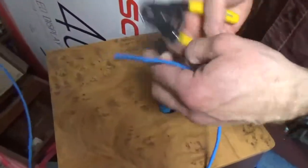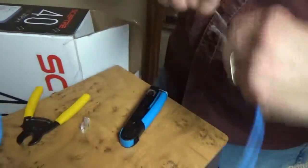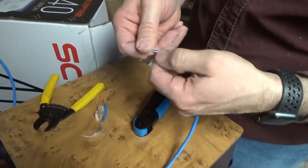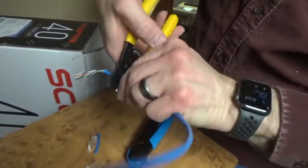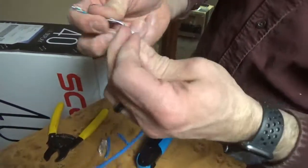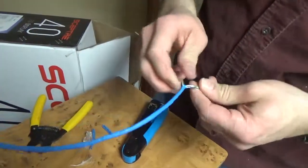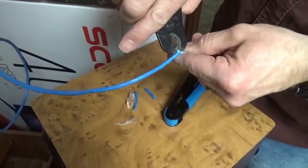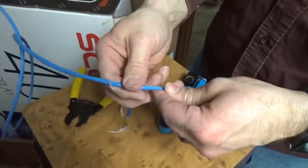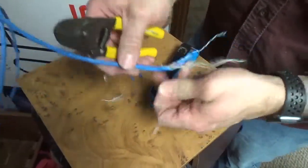We are on the other end now. We're going to stick an RJ45 on it since it's going directly into the switch - it'll have a patch panel down here. I'm going to use the same trick as before, so I cut my wire with the pull string - which is a perfect example of why I use the pull string, because that blade nicked the pull string and I just broke it. I'm going to encourage that a little bit to start. Okay so now I've got that pulled back, I've left myself lots of extra to work with and to cut off.